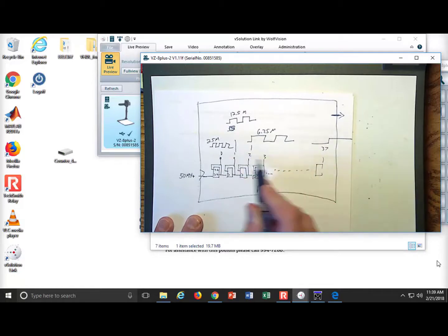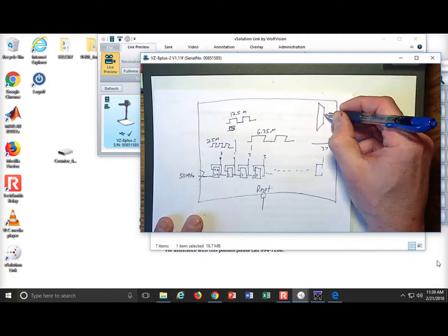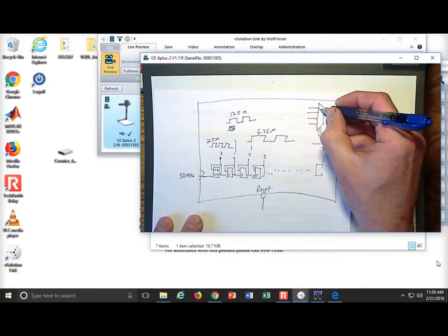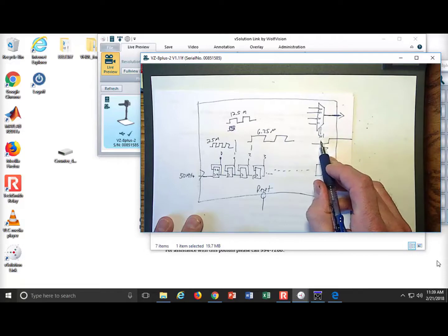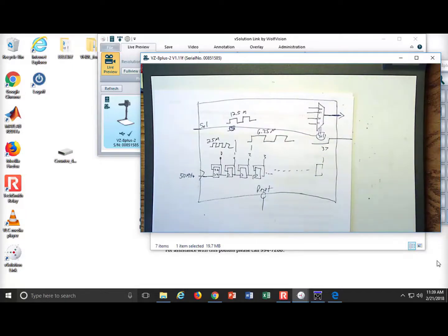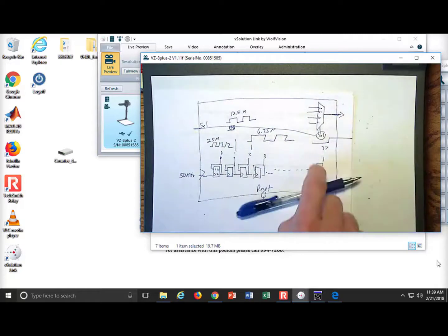You can select which clock you want because you have 38 versions at different frequencies. Route them into a circuit known as a multiplexer. Using two select lines you can address four different inputs — select codes 00, 01, 10, and 11 — wired to switches, letting you select between one of four bits of your ripple counter.